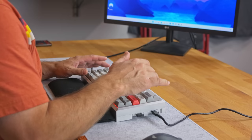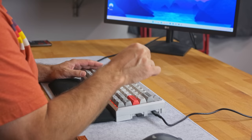Okay, it's done. And I really wish I could say that it was a cakewalk and everything went perfectly, but not only did that take over 8 hours to do all the drilling, tapping, and assembling, but the worst thing that could possibly have happened, happened. Why do deep pockets cost extra? Because in drilling a deep 2mm hole through 6061 aluminum, there's a very strong possibility that a bit's gonna break, and I broke a bit.